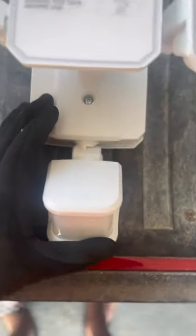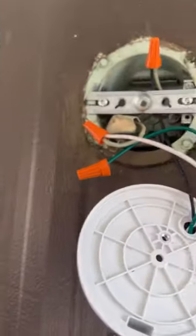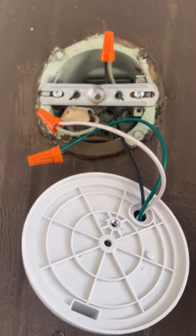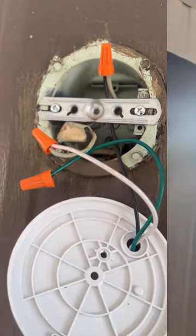My confidence was a little higher than normal because I had done some prior electrical projects around the house. But number one, before you get started, always, always turn off the electricity to the house. You can see the new bracket that I installed — you can also see the ground, the neutral, and the hot wire. I got the caps on, everything is ready to be pushed back inside, and I can get ready to install the new porch light.